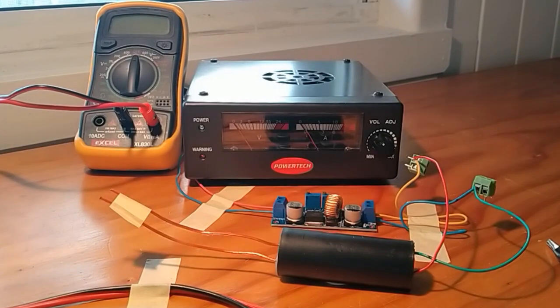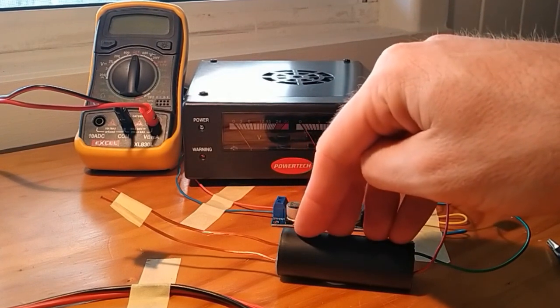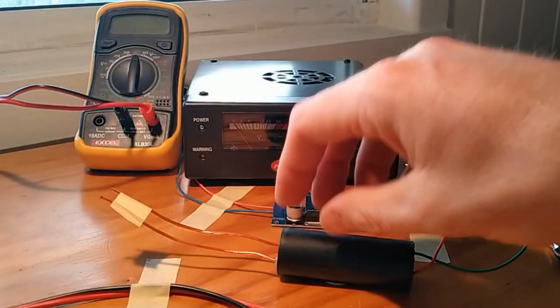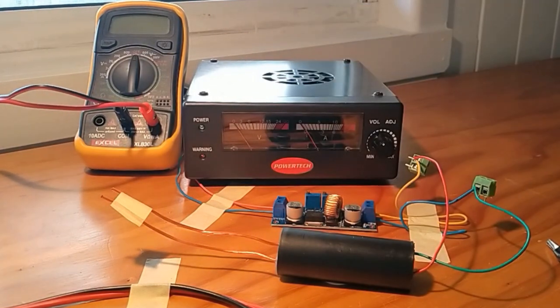Wow, that's really loud. So the reason that it's doing that is because they are so close. Schools here use these for high voltage modules to be able to show these arcs, and what it does is ionize air, etc. But what we can use it for is to be able to ionize the powder as it comes out of the gun to be able to then cling to the workpiece. So let me show you how to configure this particular module.